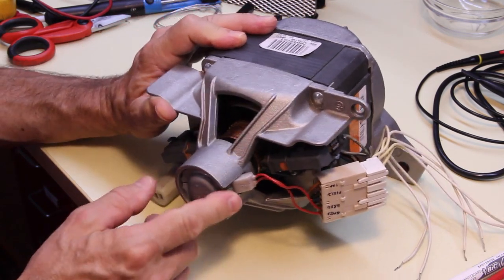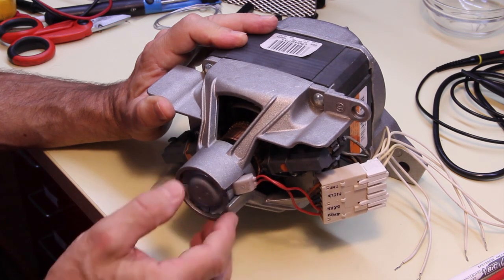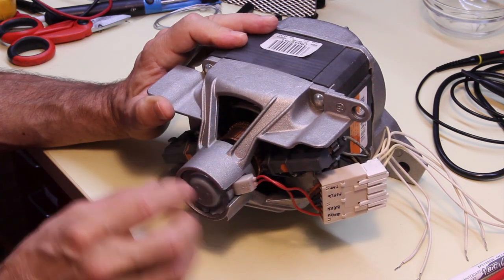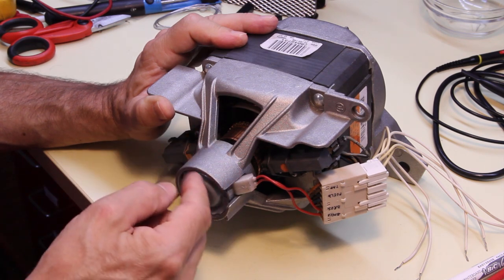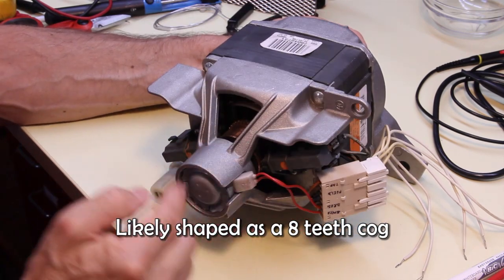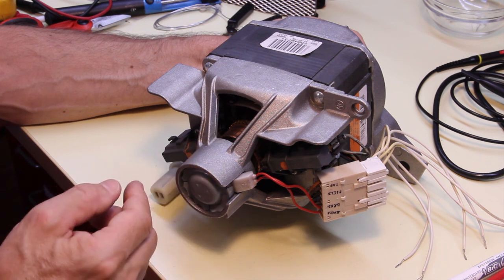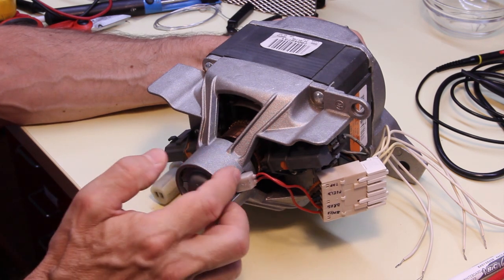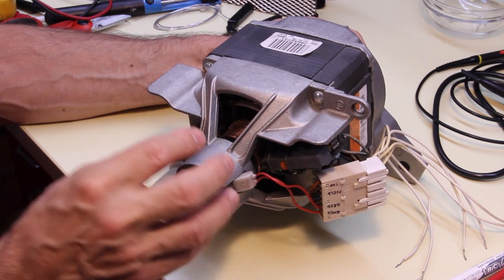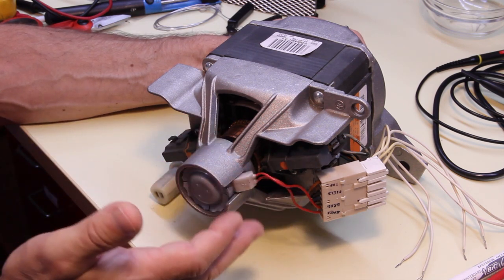Here we have in addition this thing that is the tachometer. That is a simple generator, because these motors are cheap, or designed to be cheap, so we have just a simple winding with a little magnet that spins solidly with the shaft of the rotor, and this will induce a voltage, a current, sorry, on the winding around here, that generates an alternating current. In fact, this kind of tachometer is not a DC tachometer, it is a tachometer that generates an alternating current.